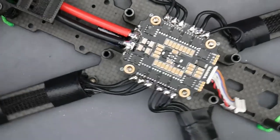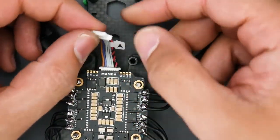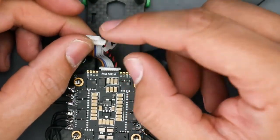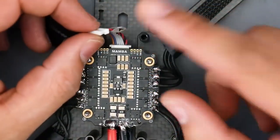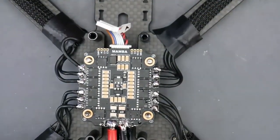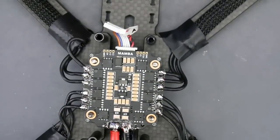Really, all we have to do is just put everything together now, just like a Lego puzzle. Now with this flight controller, just keep in mind, this right here has to go in this specific area. It has an arrow. This side should go to the flight controller, or else you'll burn it, because the power would probably be inverted. So be careful with that. Not all stacks have this, but when they do, you don't want to lose this. So make sure you keep that there so you don't fry it by accident one day when you're taking it apart and you put the wrong side in. And next thing you know, you could say bye-bye to everything here.